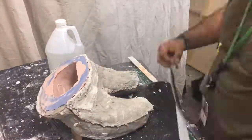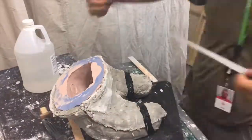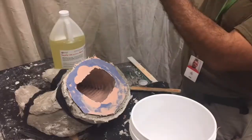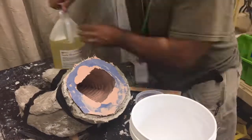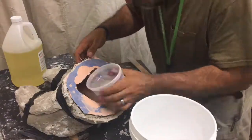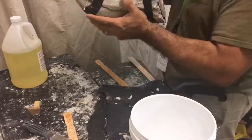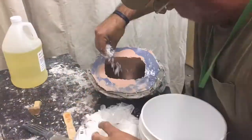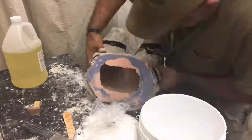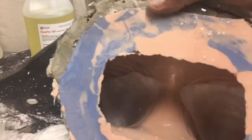I'm putting some tape there to keep it together while I roll the mold around, because this plastic is designed to be used in kind of like a spinning mold. You just move it around in there and close the surface. You'll see in a minute how it gets white as it cures — it starts producing heat, which is interesting. And then look here, you see it turning white.